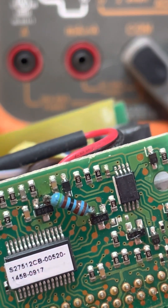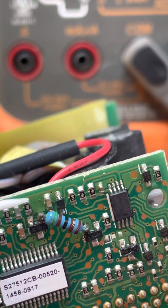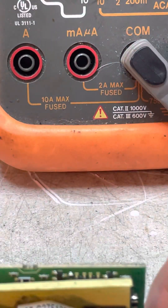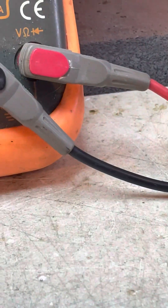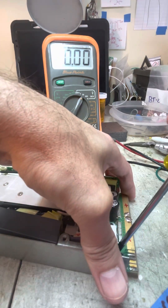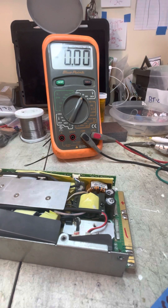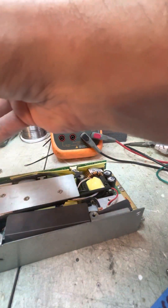You can't really go past 16 volts because the DC filter caps are only rated 16 volts, so you'd need to change those. After you get the OVP modification done, slide your board back in and put all four screws in before you power this up, because it uses the chassis for ground. If you try to power it up without all four screws in it will go bang — and whether you paid ten or twenty dollars or got it for free, you don't want to destroy it intentionally. Get all the screws in, then I'll show you how to set the voltage.